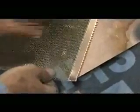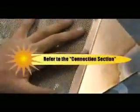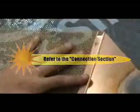With the Z-Mesh installed and length verified, make the connection between the second cold lead and the second transition plate. With the cold lead connected, place the transition plate in the proper location on the roof and cut the Z-Mesh to the appropriate length. Then make the Z-Mesh to transition plate connection. Please refer to the connection section. When the transition plate cools, secure it to the roof.